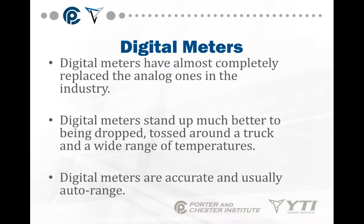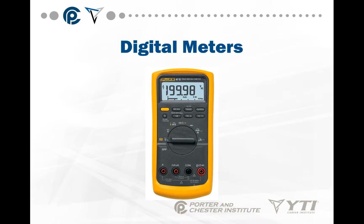Now, one note on digital meters that's sort of important. They're as good as the batteries that are in them. So as you use it, make sure you have extra batteries around because the digital meters are as good as the batteries you have in them. And this is just an example of one of the styles of digital meters. You'll notice that on the knob, the adjustment and selector switch, there's only like one voltage, millivolts, ohms, and current.